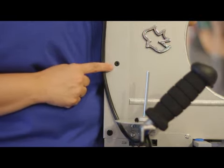A lot of times customers will just make a small enough adjustment on that screw just to stop the bunny. But the more the machine breaks in, you'll be coming back in to do the adjustment again and again, and eventually you can wear out this little screw. So make sure you make a nice big adjustment on that screw the first time. Then it may be six months to a year before you have to come back in and adjust again.